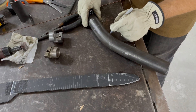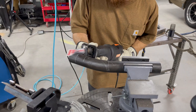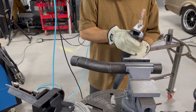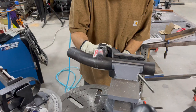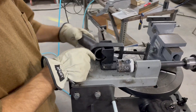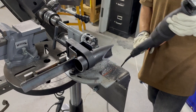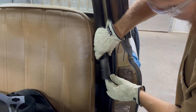This little piece was special because we're taking a section out of the bend area. We ended up with a very extreme angle that could not be done with the hole saw, so we did it completely manually. We used the sawzall to lop off most of the material and the remainder was finished with a grinder and some trial and error — angles like that, so you have to compensate.